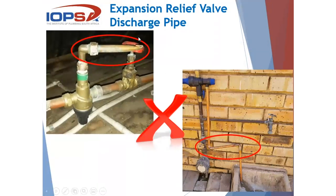Here's a real-world example: a PRV that's been installed where water was obviously dripping at some stage — you can see the marks — and this person decided to just block off the pipe, which will have damaging consequences. Another typical example shows a PRV nicely installed, however the elbow is 90 degrees instead of 45, which according to the regulation is not correct. You will also note that between the water meter and the PRV, there is a draw-off for the garden tap — which is correct.